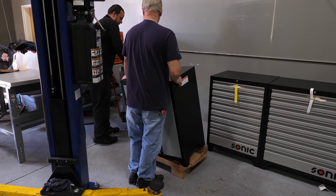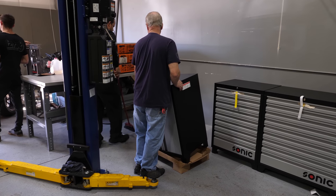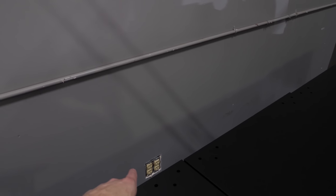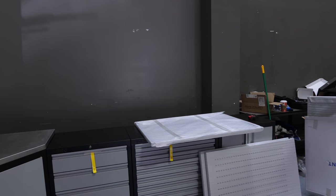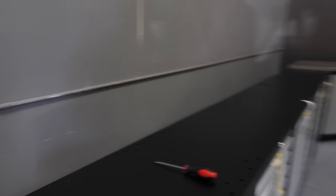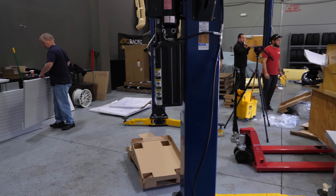And then the 26 inch closet on the side. Alberto and I were talking about outlets, and I was telling him how we did mine. We have a quad outlet here that we'll be able to snake around and put various power strips wherever needed. And then it would probably make sense to junction off of that and put a box here somewhere so that the guys, when they're working on the lift, can pull extension cords where needed.